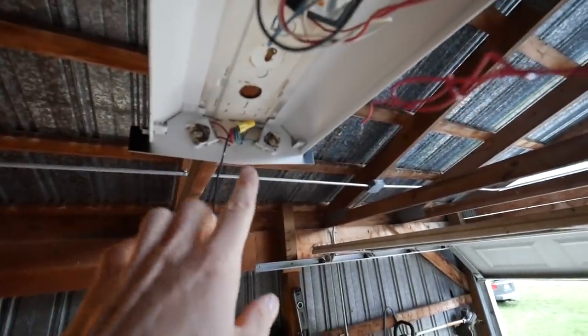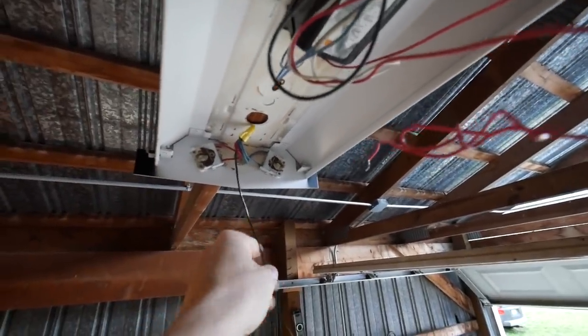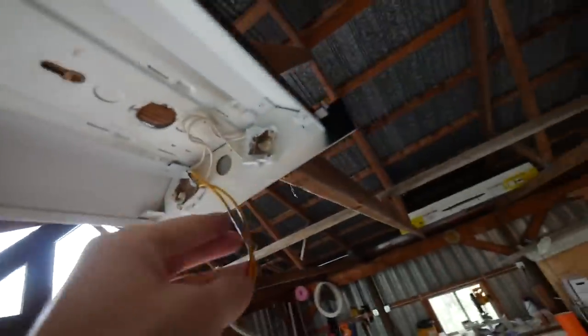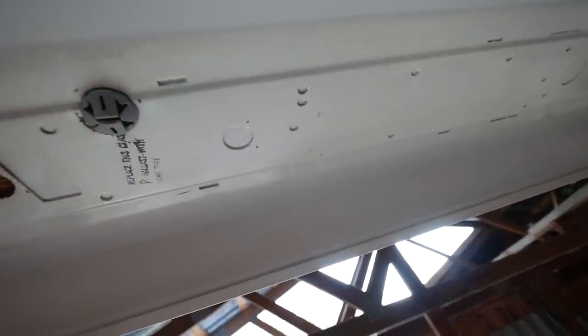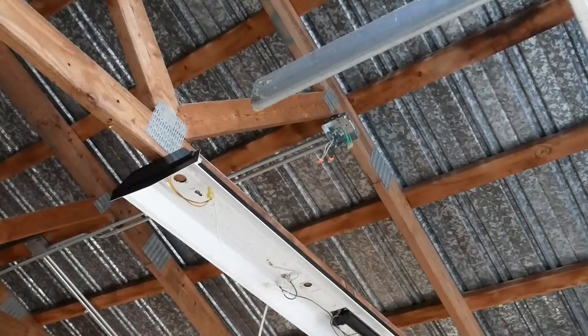So this is gonna vary depending on what type of LED bulbs you get, but on mine, all I have to do is connect one wire to this end. You see, I just joined all of it together. So this end's gonna be hot. And this end, I just connected to a white wire. This is gonna be neutral. And let's get the power hooked up. Let me put these together. You wanna give me that white cover?